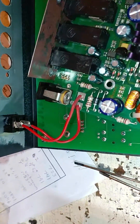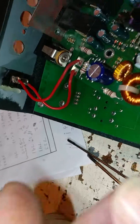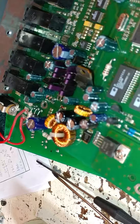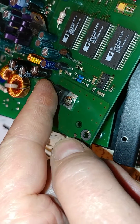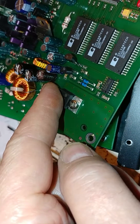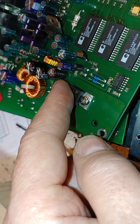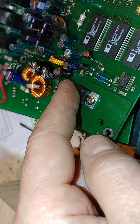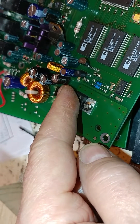One thing I don't like is it looks like they soldered onto the leads from the rocker switch for the main power. I think I have it out enough to get at the capacitor, which I believe is the one people say is the problem. My issue is the modulation lights come on, the system boots up, but when you hit it with MIDI it just goes back into a reboot. People say this capacitor is the problem.